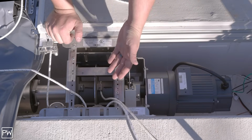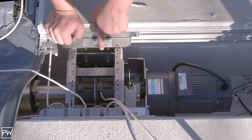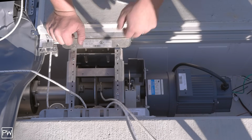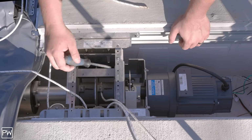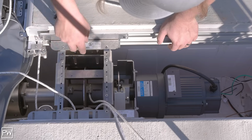If you're doing a CS3000 system, there's gonna be another set of pulleys on this front side you'll go through. And once you go through those, you'll go underneath and you'll still take the ropes this direction. So the ropes are always going like this towards the pool. I like to think we're near the end of the project. We're going swimming, the ropes are jumping in towards the pool.